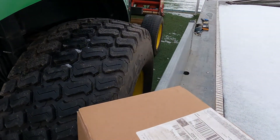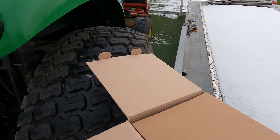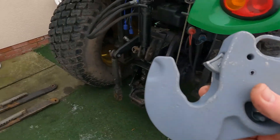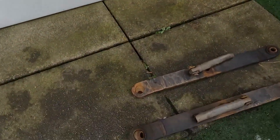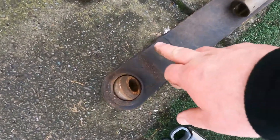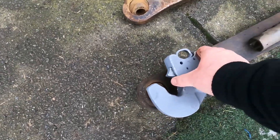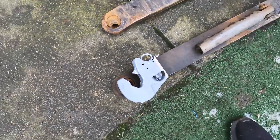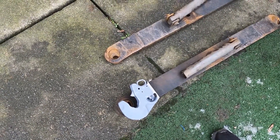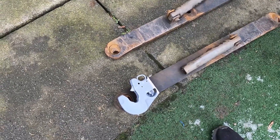To replace — or rather to modify — what we're going to be doing is having these hook arms fitted in place of the traditional ball ends. They'll be cut off where they've previously been welded, our fitter will then weld these new ends on, we'll give it a spray of paint to tidy them up, and we'll have hook lifts on the end of our three-point linkage arms.